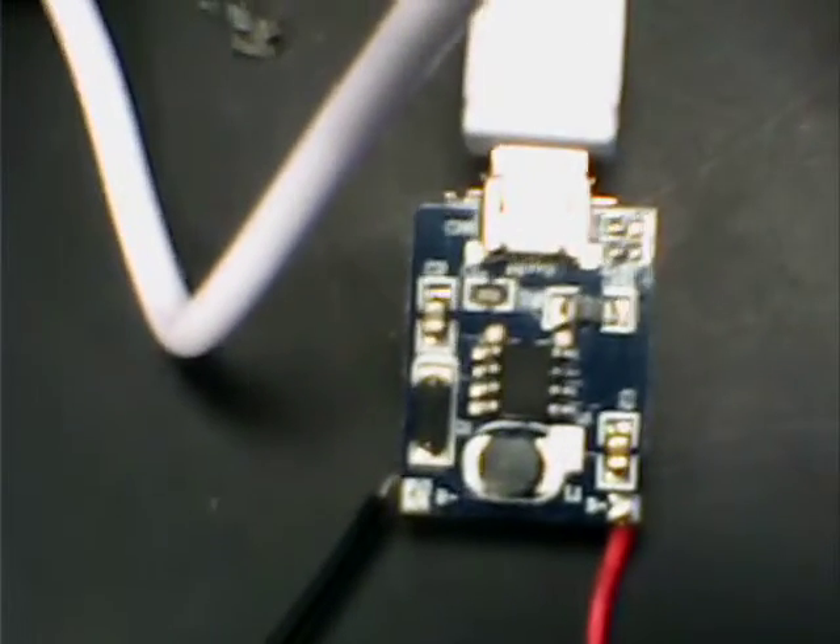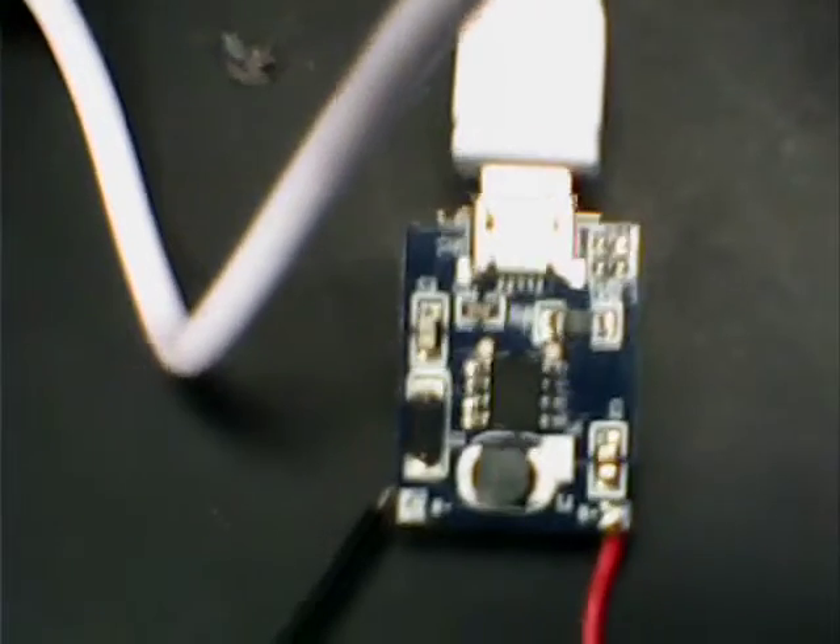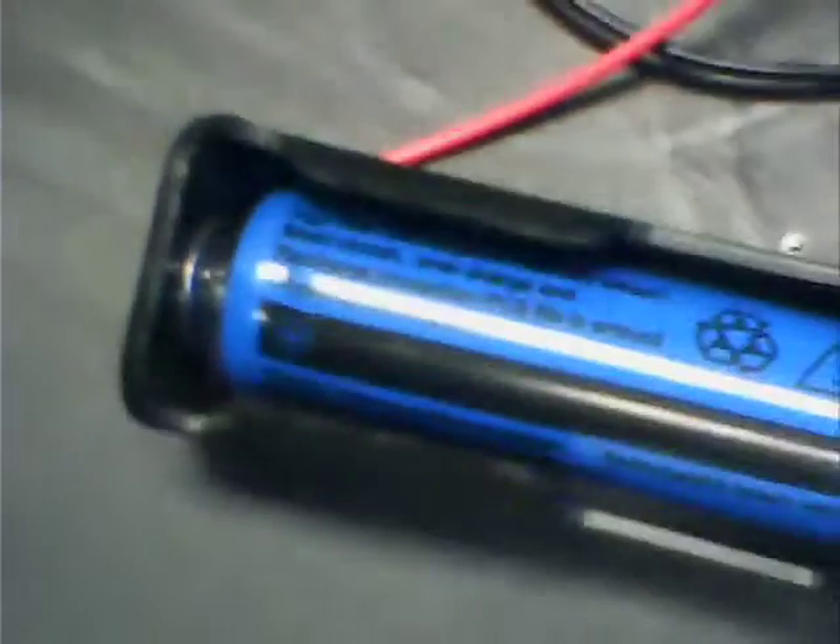It'll go over five volts, and that gets plugged into the port on the Mac or PC. So the bottom line is, if you get a TP4056 board and solder a cradle, the charge doctor is optional. You plug that in — there are LEDs on the board. This board does not have an inductor, so it's not going to take you up to five volts like a power bank board, but it'll get you fully charged and it'll stop. The red will stop flashing — sometimes a blue light comes on — or you can check it with a multimeter. It'll work just fine. You get a good contact and good fit with the magnets, and you're good to go. Thanks for watching.